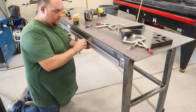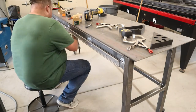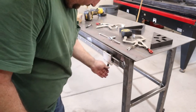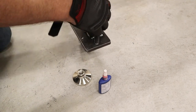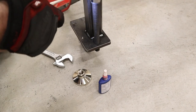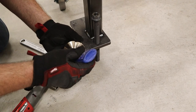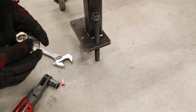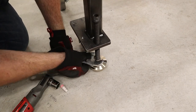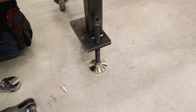Just getting this extruded aluminum mounted here — it's just using some quarter-20 bolts. In a second you'll see the carriage that I'm going to slide on the end. The second part will be building all the roller stands and the supports for the saws, which are going to be wall-mounted, so the saws will be mounted on the wall with some drawer slides and the ability to slide in and out to access the rollers on the front of this bench. Here's another McMaster-Carr purchase: this leveling foot. If you don't put a leveling foot on like this, when the bolt touches the ground and you're trying to drive it down it's going to move the bench all over the place. But this foot has a little bearing in it that allows the bolt to turn without moving the bench. Please like this video and subscribe, feel free to ask any questions in the comments, and we'll see you in part two.